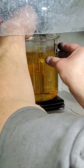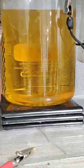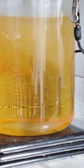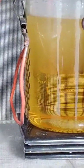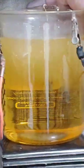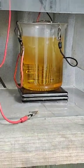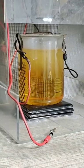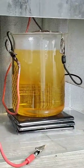The rhodium is two parts special acid, and there is a rhodium itself. It's a metal, and it's in liquid form inside this water, that yellow water. What the machine is doing is it has positive and negative. The positive and negative activates this liquid metal rhodium, and it will start pulling onto the silver slowly. We control it with temperature and the current, probably 4 to 5 volts, and slowly it's grabbing onto the silver, coming onto the silver, and coating the silver.